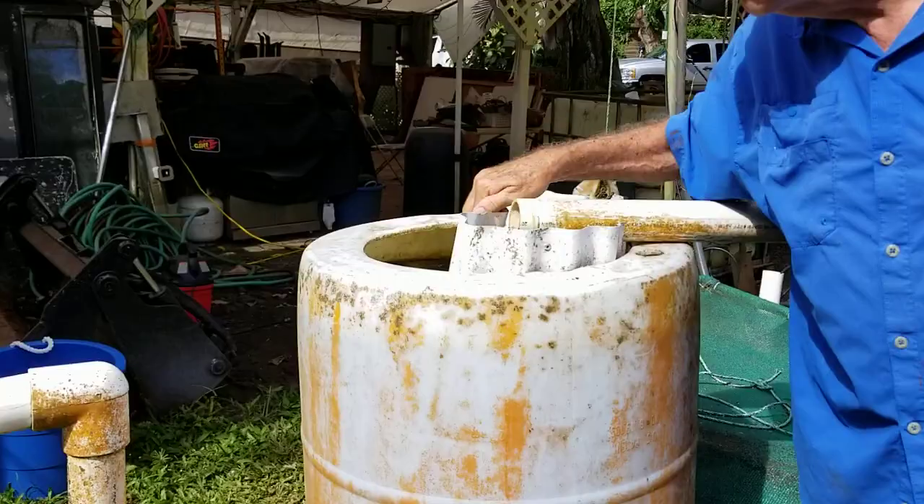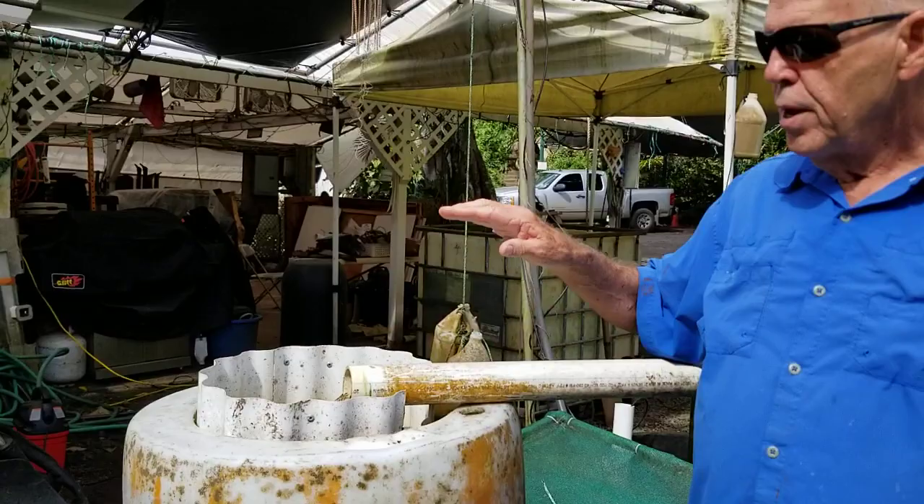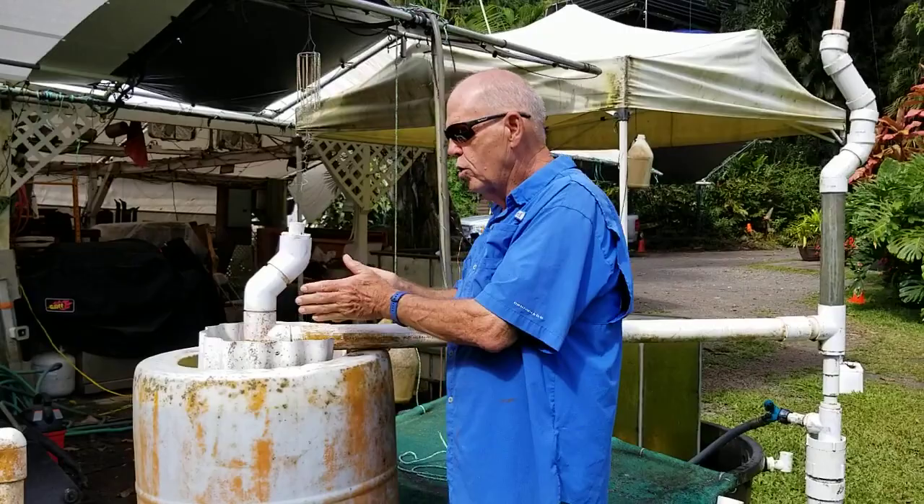You see the pipe over here to the side here? I'll hold this to the side — that's the decanter pipe on the side there. And so the water releases from there. Notice how clear it is here? So the dirty water comes in here and when it falls it's heading down. We put this on it and all this does is make the water go left and go right, so that it takes off the speed of the water.